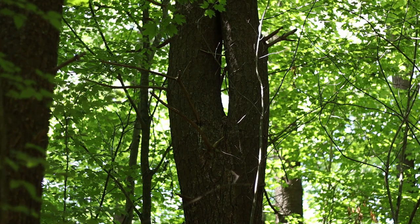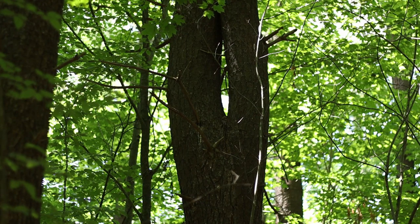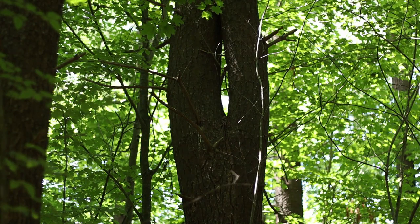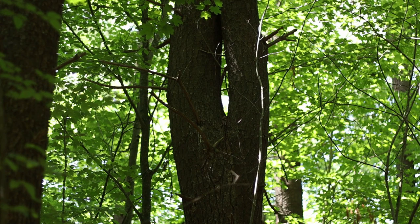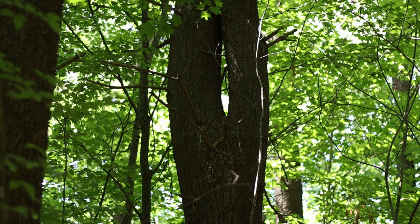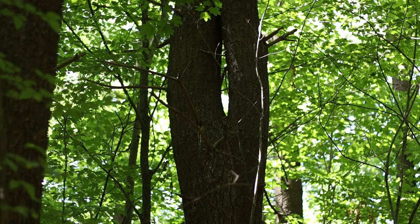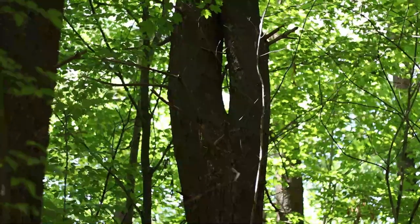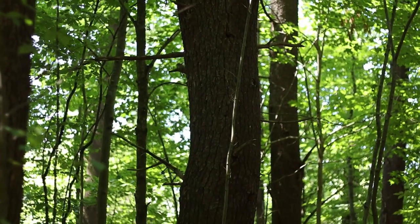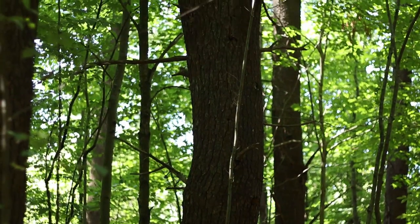That crotch right there is probably about 12 feet off the ground. So the way that thing's growing, probably quite a ways down that trunk, you can kind of see, it's hard with how bright the backdrop is, but you can see a crack down the center of that crotch. There's probably a good sized bark inclusion on that end. If that was a hardwood, that'd be beautiful for some tables or something like that, but we are looking for timber framing stuff. And if you look down the trunk, you see it takes a pretty good bow right there. So to me, that's a timber that I really don't want to use,